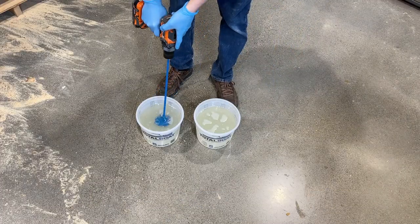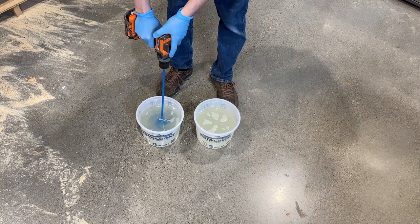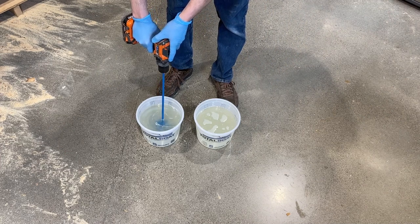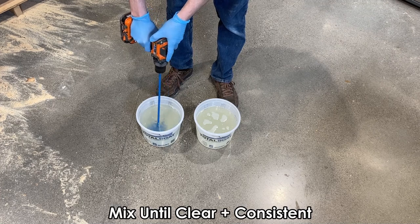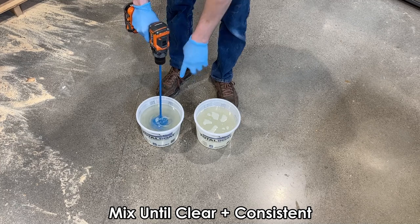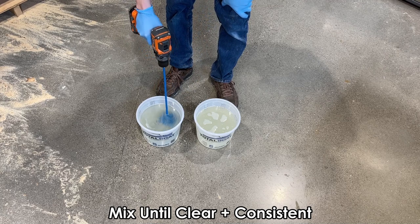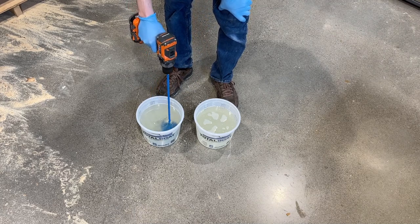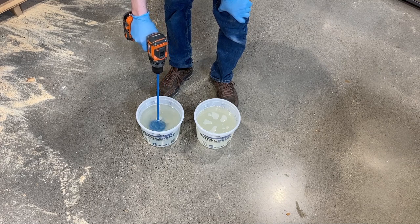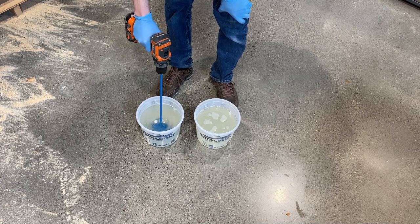You're not in a rush — do not floor it, otherwise you're going to have resin shoot everywhere. Start slow and work up to speed. Just like our hand mixing method, we want to mix this for about three minutes or until you don't see little ribbons and swirls in there — that means your resin is not fully mixed. You want basically clear resin. Bubbles are okay, but you want to avoid that murky, swirly texture inside the bucket.